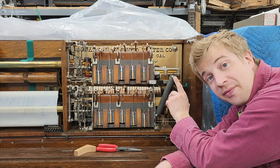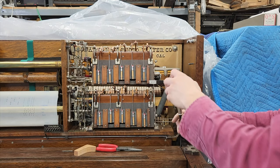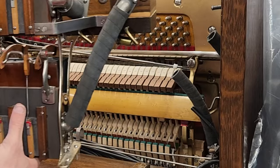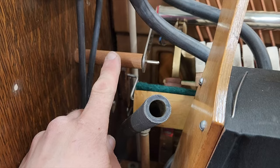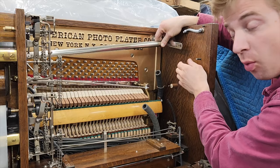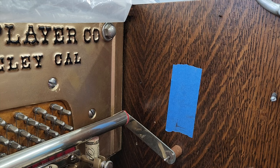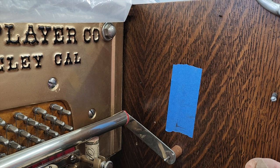These are the two motors that drive the rolls, but they're kind of in the way over here, so I'm going to pull them out so we have more room to work. I've got my standoffs in, one on either side to get this rail aligned where I want it. This rail is shimmed up where it's going to be at the rest position. I made a temporary mounting for it — I don't want to drill any holes until I'm sure I've got things where they need to be.